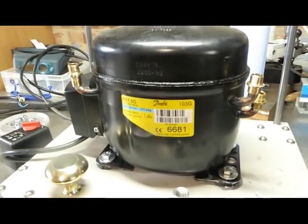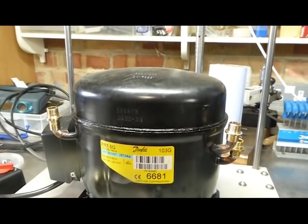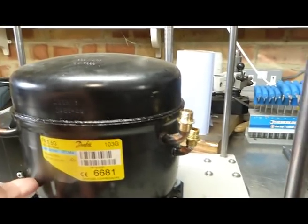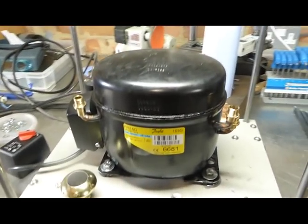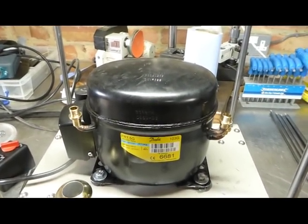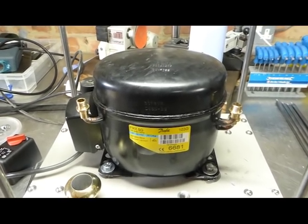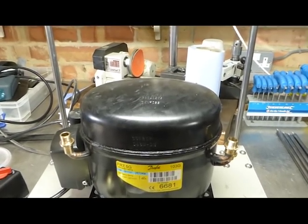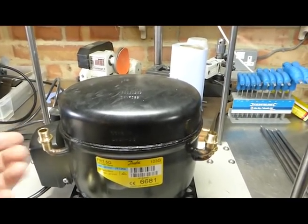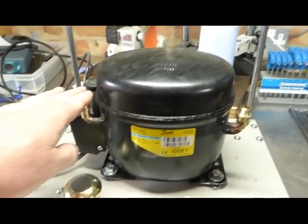So one of the first issues that I found was I had no idea which of these pipes were the air intake, oil intake, and the air outlet pipe. And the wonderful Dimitris from Jimmyscanal on YouTube gave me such an easy solution for that: you start up the motor, hold a piece of tissue paper, and see which of the pipes blows air and which one actually sucks air. It was that simple, and I felt pretty stupid once I'd realized it was that simple.